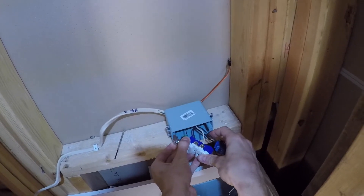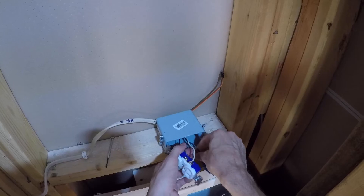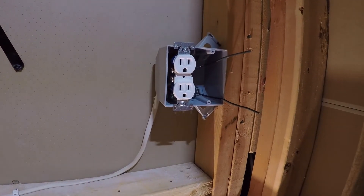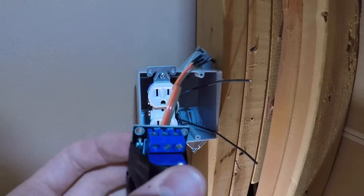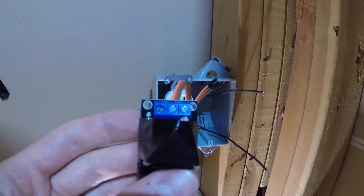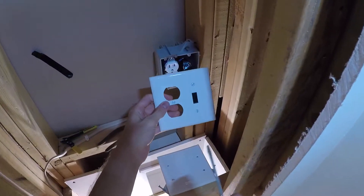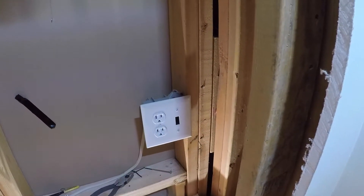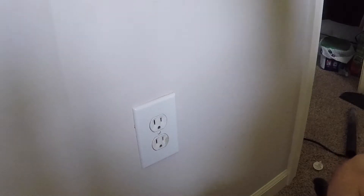I was having a really hard time fitting everything into that box, so with a little bit of movie magic, that box was replaced with a two-gang box instead of a single — a lot easier to fit all that stuff into. Here's the relay again: these three terminals tie into the hot and ground wires from the outlet, and then the three colored ones go out the bottom right hole and attach to the Arduino. I got a cover for the box with some electrical tape over the outlet hole — yes, I know they sell covers with blanks on one side, but they were out of stock.